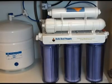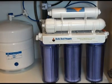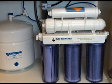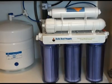You will need to occasionally change out the filters on your system. The first filter is a sediment filter, which is going to remove most of the large particles from your water. This helps ensure that the carbon blocks don't get prematurely clogged and should be changed when it's visually brown. The other two are carbon blocks and will remove things like chlorine and volatile organics — they should be changed every 6 to 12 months depending on use. If your household consumes a lot of water, change them every 6 months. The smaller filter on the top is also a carbon block used to remove taste and odors, and should be changed when the other carbon blocks are changed. The filter in the larger canister on top is a reverse osmosis membrane and typically lasts around 3 years.